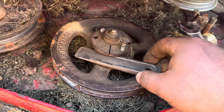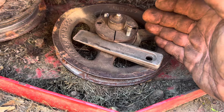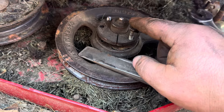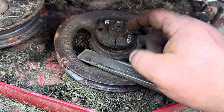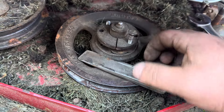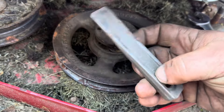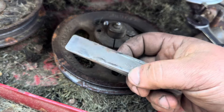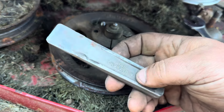The longer the wedge keeps you out of hitting your pulley, and the gradual taper helps do it more evenly than taking a cold chisel and hammering it in there. So we just did that. Once I have this off, I'll clean it all up and I always chase the threads. I'll put higher quality bolts in them. If these break, it's no big deal — these long wedges, you can find them at any welding supply store. They come in handy for a million things, so I definitely recommend picking some up.